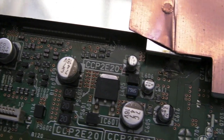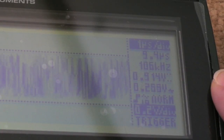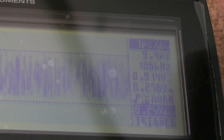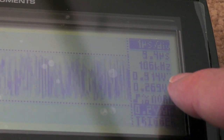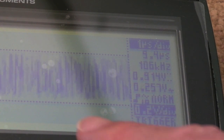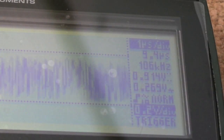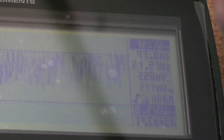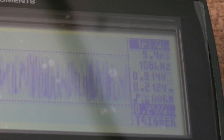So just testing now with this old portable scope — you can see 914 millivolts there. It's having a problem triggering at the moment; the marker at the bottom is just a little bit low, so it would represent a slightly lower voltage if I moved that marker up. As it goes in and out of loading you can see it does get nearer to the bottom. So we're not far off the 900 millivolts I was going for, and as you saw, the DC voltage the multimeter was reporting is what you'll see when aiming for around 900 millivolts on this particular model PlayStation.